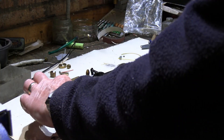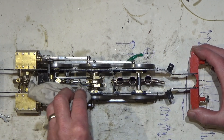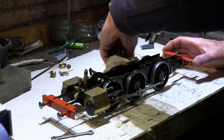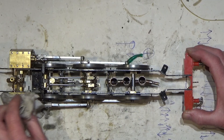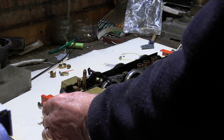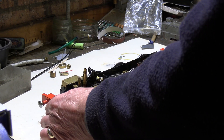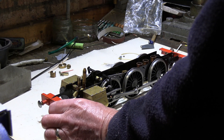As we saw earlier on, there is a leak coming from that cylinder cover, which I'm going to look at to see what's causing that. It might just be the screws not tightened up evenly. But I hope you found that interesting and we will move on to the next phase. What I'm going to do now is carry on with the painting. We have our running chassis on steam, which is a big milestone, so I can carry on with painting the rest of the locomotive and the assembly.